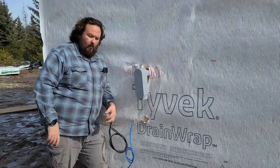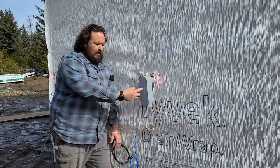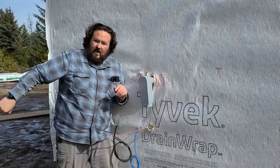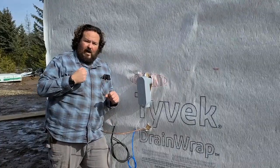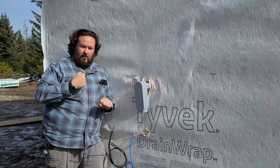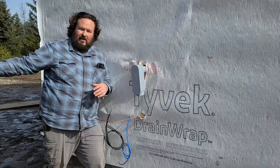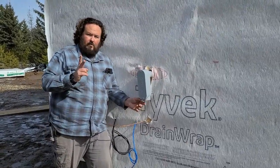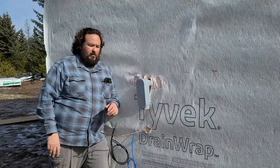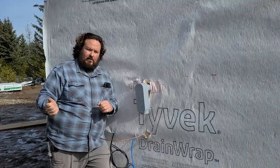We've got to get from here all the way around. One thing we had to consider is that we've got not only the sweep at the bottom underneath the meter, but we've got a sweep that comes up into the back of the panel, and a curve to get around from the side of the house to the front. When you're pulling wire, every time you have one of those sweeps — a turn — you create friction in that wire as you're pulling it in. We're going to put our trench in a sweep, just bending the conduit as it goes, to minimize the number of sweeps. We'll end up with two instead of three. There will be some friction, but less than having three sweeps. You never want four sweeps because you're essentially making a full turn — it becomes very difficult, nearly impossible, to pull wire through that.